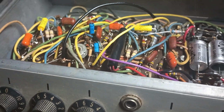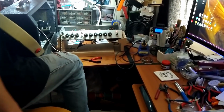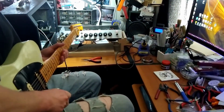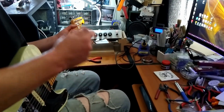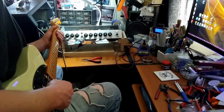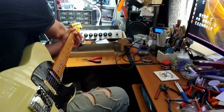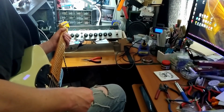Should be awesome. All right, we have the cold biasing resistor installed, and the results are in, and it's not exactly what I was expecting, but it's interesting. The amplifier normal channel is much quieter now. So we'll put it on 2 where it was before. And 2 before was kicking up the jams. Very quiet, very clean. Oh, very out of tune. So about 6 now is where 2 was before.